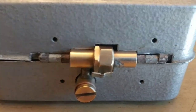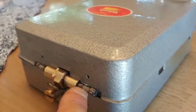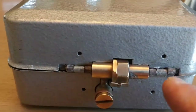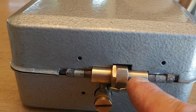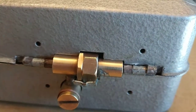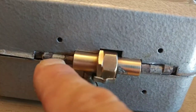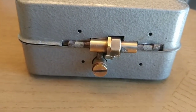I tried hitting the pin, tried to knock it all the way out — didn't work. Tried to hit it back — didn't work. Then I got to thinking: is there really a hole going through this hinge mechanism? And there had to be another chamber for the gas to go through. So I bent this tab up — or actually bent it down, just because it was easy to get to. The pin in here — there are two separate pins. This one slides out this way, and that one slides out the other way. I was able to get everything out.